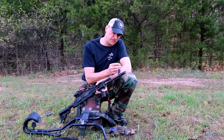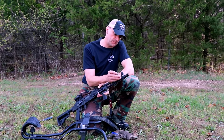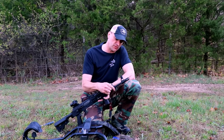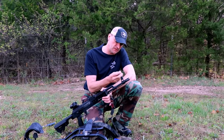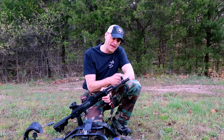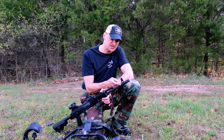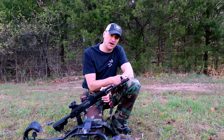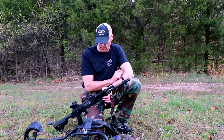The correct way to fix this problem is to drill new holes — slightly larger than the original pins — and drill this out, then put new pins in the front post and secure it in place. For this I strongly recommend having a good drill press and drilling it out cleanly, because I have seen people using power drills where the angles were not always right — they've boogered those holes. So method number two takes a little more time, is not as clean, and requires some tools, but it is absolutely doable.